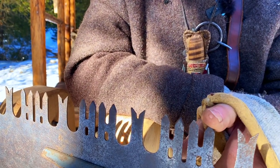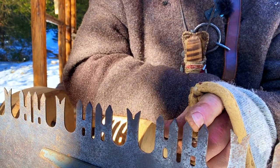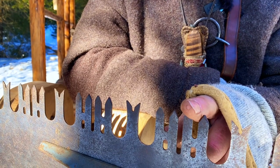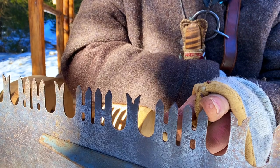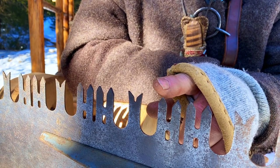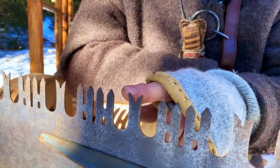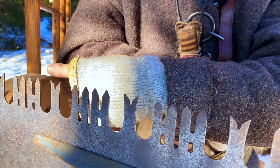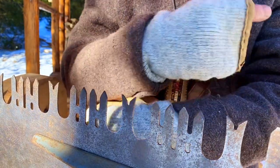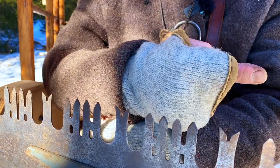It's approximately 4 feet long, so you could put a helper handle on the end, and two people could use it, but it was typically used by one person. So cutting teeth separate the fiber. The fiber is chiseled by the raker. The chips or curls of wood go down into the gullet, and they're carried out on the push mode that way, and they're carried out of the log or the cut, which we call a kerf, in that direction.